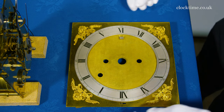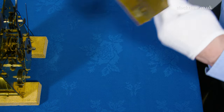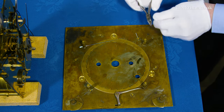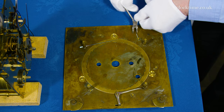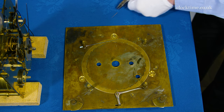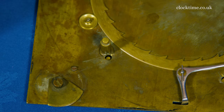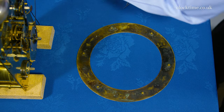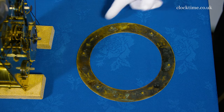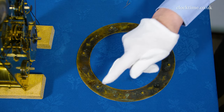And then the whole thing has been flattened again and re-engraved without them. So I'll turn over the dial plate and just remove the last of the pins. When I pick up the dial plate, it'll leave the chapter ring face down and then you can see how the half-hour markers have all been beaten out all the way around in the chapter ring.